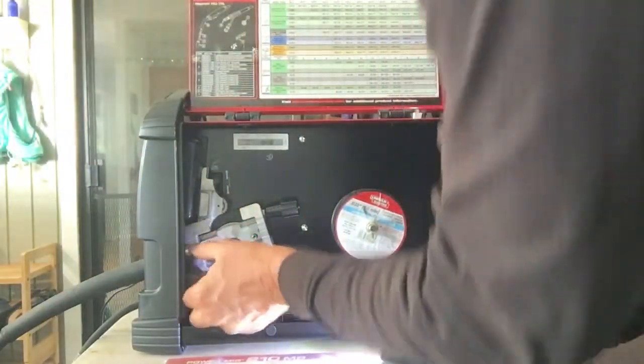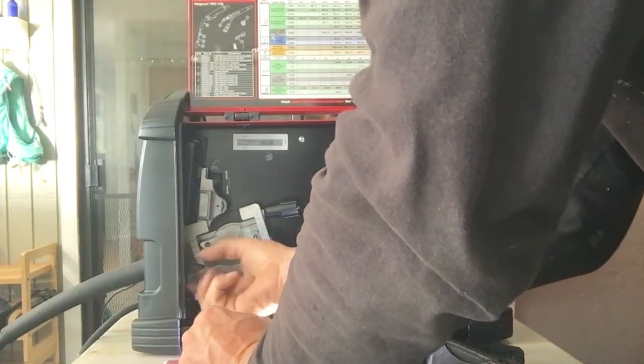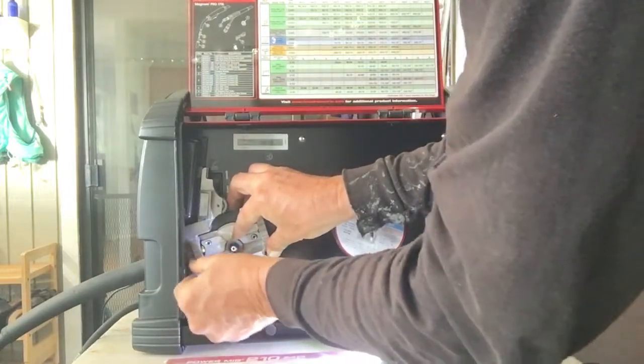Oh yeah, I forgot. You gotta have the liner. To change this, you gotta pull the liner. I forgot that about these Lincolns. You gotta slide the liner out a little bit, drop that in, and then the liner fits in the groove like in a pocket right there. It's a good idea.